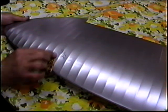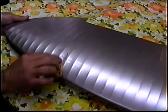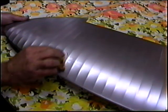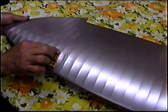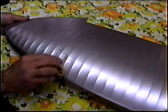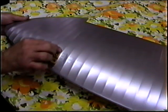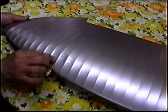But again, you can go back and sand 20 coats, 30. You can do this infinitely. As long as you sand off more than you put on, you're never in trouble. And each time you do it, you see that little high spot is coming right through it. When I go to touch this up, I'll put an extra coat right on that spot. I'm trying to avoid sanding right on that high spot.